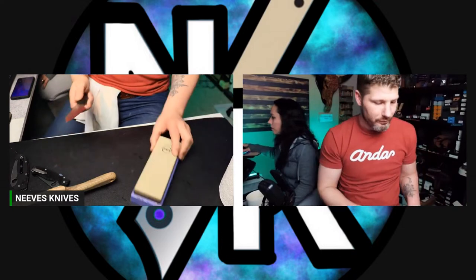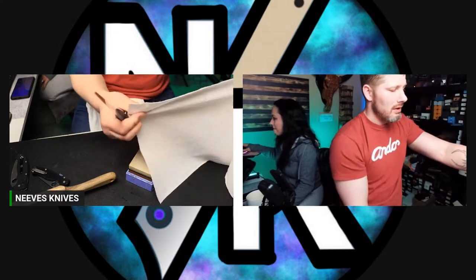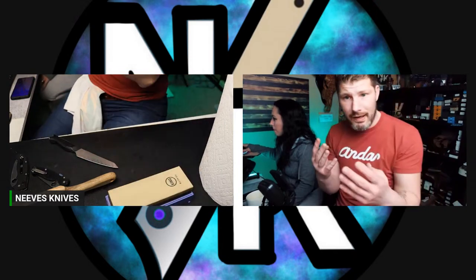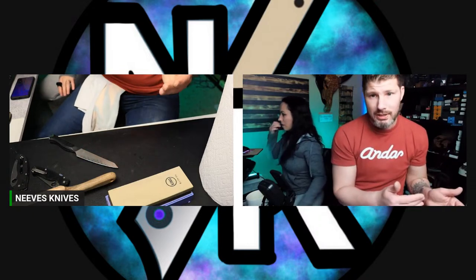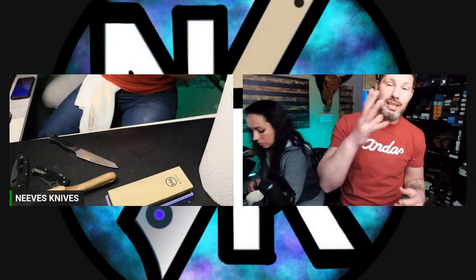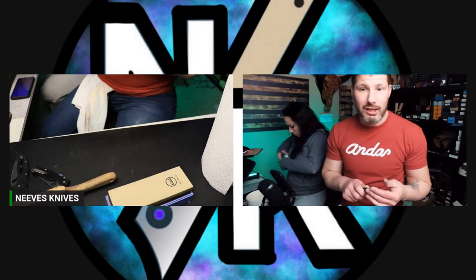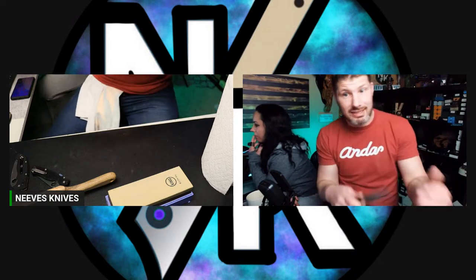But yeah, no, this is super sharp. In order to cut through paper towel, an edge has to be very clean. The apex has to be clean. It has to have enough bite and enough fineness to do it. So you can't have a toothy edge that's not refined and go through paper towel. It'll just snag the paper towel. It has to be fine enough to go through, but if it's too fine, it'll just slide off the paper towel. So it has to have enough bite too. It has to have the best of both worlds. That's why the most perfect edges are going to be able to cut paper towel, especially for EDC purposes, maybe not for shaving purposes, because for shaving you don't want bite. It's the exact opposite.